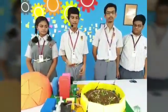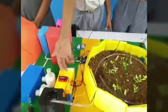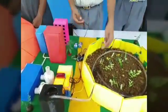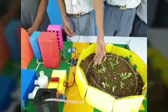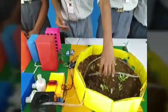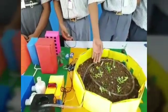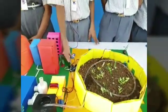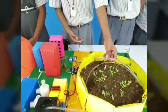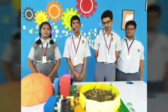I am going to demonstrate the working of our project. First of all, the Arduino is connected to the relay module and the relay module to the water pump. When we give the power supply, the soil moisture sensor senses that there is no water in the soil and sends the signal to the Arduino. The Arduino sends the signal to the relay module and the water pump starts. As soon as the soil moisture sensor senses that water has reached the soil, it again sends the signal to the Arduino and then to the relay module, because of which the pump stops and the water stops flowing into the soil. We have used drip irrigation method.